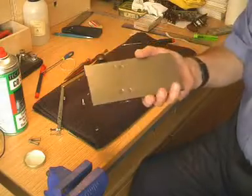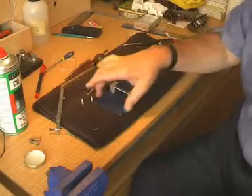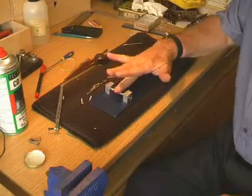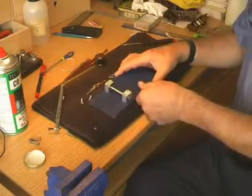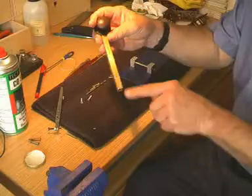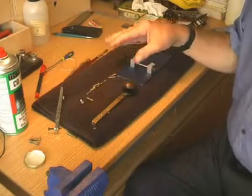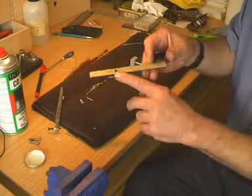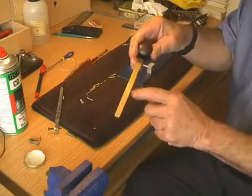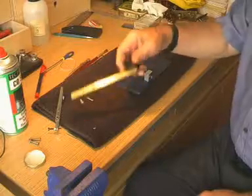To sum up, we've replaced the bolts underneath the key by countersinking them, so that's removed. We've got no problem now about having a sheet of rubber or thin rubber underneath. Countersinking them did slightly reduce the amount of adjustment we had there, but it's still running very well. The arm has been drilled, and they're using the same knob that comes from the old key. The backstop is there, which is tapped right through, and we're going to use 4BA because the thread is fairly fine to give us some adjustment. The only bad thing at the moment is that the 6mm shaft occupies so much of the depth of the arm that there's only a very little bit of thread there in this 6BA tap to put a little screw in to secure the arm to the shaft. So that is a drawback, but I didn't think of that.